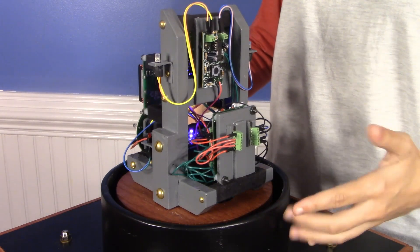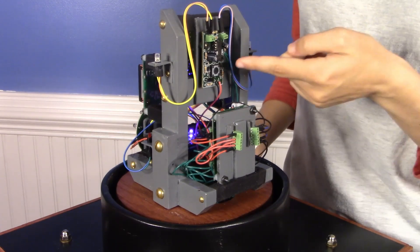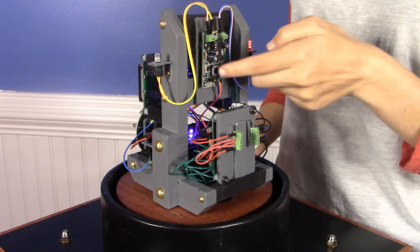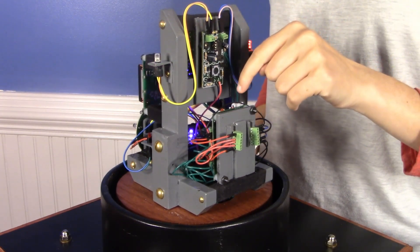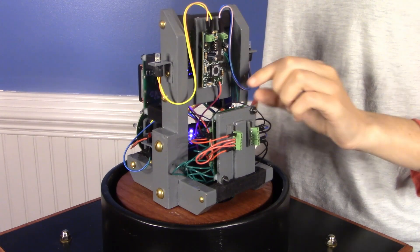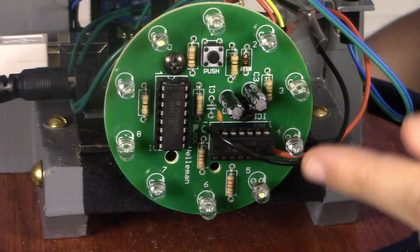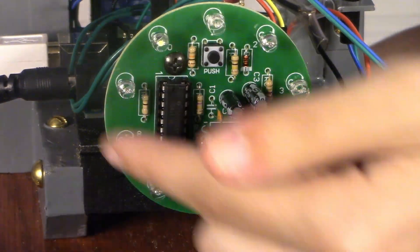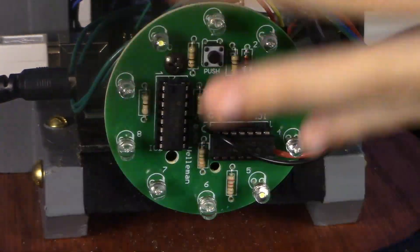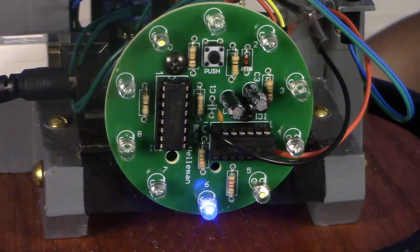This is the back of the dome and this is the power distribution center — we have one transformer that drives all of it. This right here is the back of the circuitry for the yes/no decision maker. The coolest part is this: the circuitry for the remote control and its antenna. That's the radio receiver right there. The roulette wheel has ten LEDs and just spins in a circle by turning on different LEDs. We put in our own more powerful ones because they look cooler.